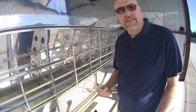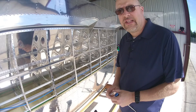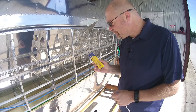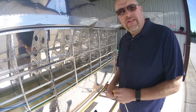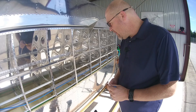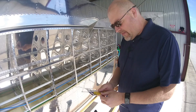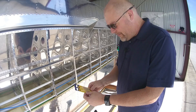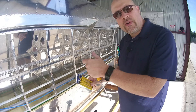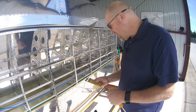I went and looked for Torx screws. I even contacted Vans to see if they had Torx screws they would sell — they said no, you get those at an auto parts store. I went by a couple of the auto parts stores locally and they did not have them. So I'm going to research online and see if I can find some inexpensively. But in the short term, I have to get these four screws out. I've got a couple of these spiral extractors where you turn it in backwards and that allows you to pull it out. I'm going to give that a shot.